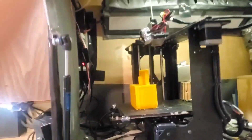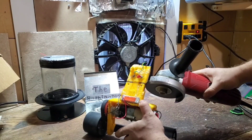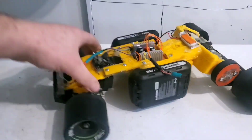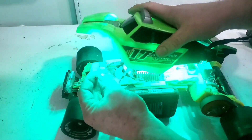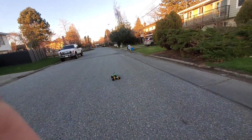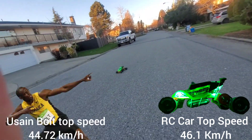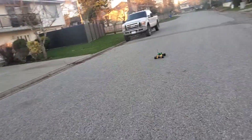So I decided to do one last thing: the 20-volt to 40-volt conversion. I jumped back into CAD and designed a removable battery expansion for my current battery setup, and optimized the space between the battery dock for a storage compartment for high-current components. After a few more adjustments it was time for the final test drive. I managed to take it up to 46 kilometers an hour — which makes this thing officially faster than Usain Bolt. Not bad at all for an overclocked drill motor that was never intended to run an RC car.